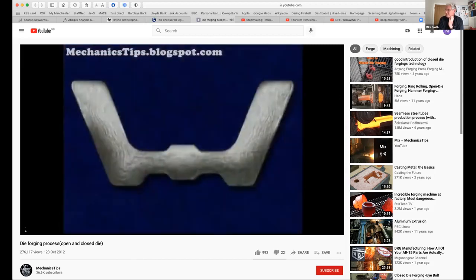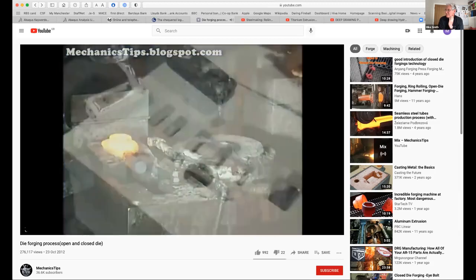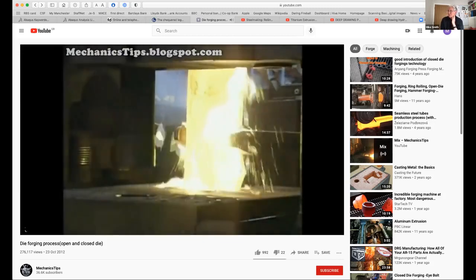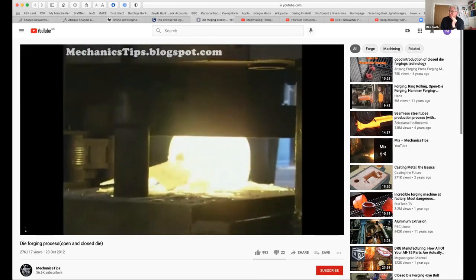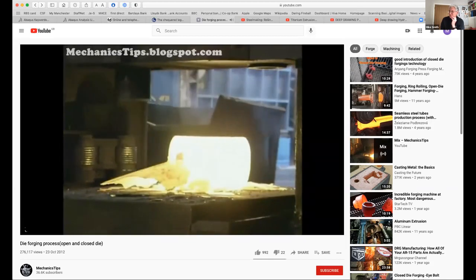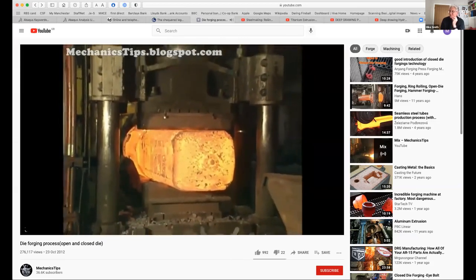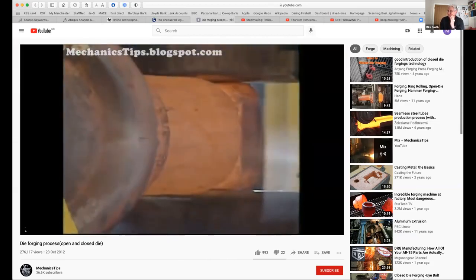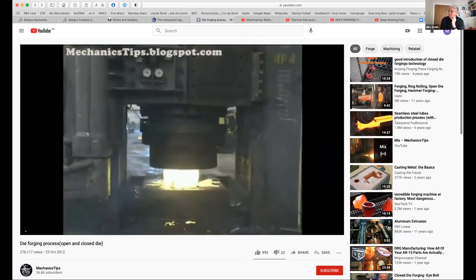Because of these effects on microstructure and grain flow, the mechanical performance of wrought mill forms and parts is typically superior to that of cast metals. Open die forging is performed on ingot, billet, bar, or a preform, and is the deformation of a workpiece between flat or shaped dies without completely restricting metal flow. This deformation can result in lengthening of the workpiece while reducing its cross-section, upsetting regions along the length to greater sizes than adjacent regions, or bulging the workpiece's cross-section while reducing its length.